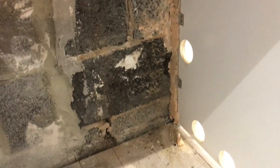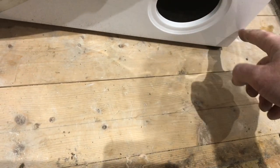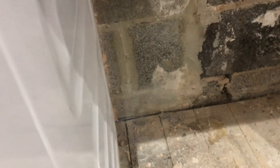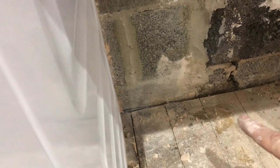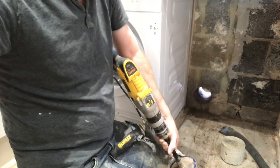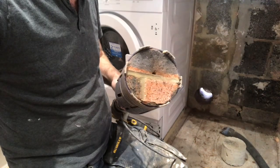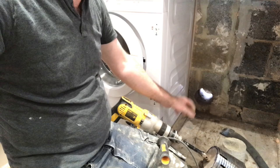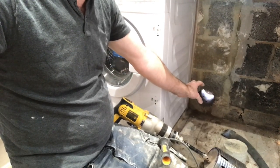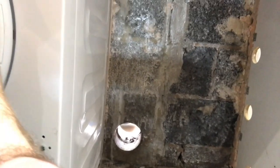All I've done is gone and got the dryer, come back, cut it straight — beautiful. Now it can go in. That's the outlet for the dryer. So we just measure there, centre, measure there, centre, measure the back point — cored and all out. Job's a good'un. You can see I've cored it out. When you're coring holes, you always need a decent core bit — it puts a lovely hole through it. On the outside it'll be lovely, it won't be smashed. Now our vent is going to go straight through there. Cleaned it all off, nice and clean, go straight through that hole.